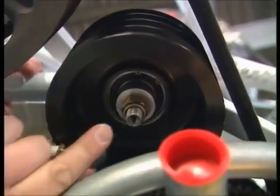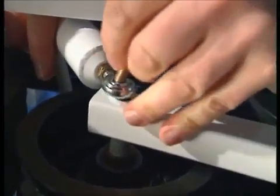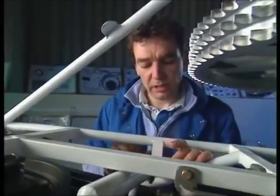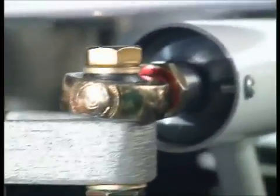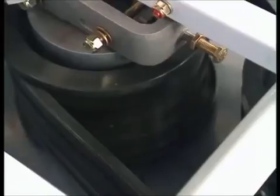Next, the other clutch arm, which has one bolt underneath and then another bolt in the top like so. You're beginning to get the idea. When it's engaged, this over-centre arm here locks into place and pushes this pulley right out to tension the main belt. But when you take it off, what is very obvious is the main belts are far too slack. So I've already tensioned up the drive belts that go to the tail rotor, and the same principle is used to tension these main belts.